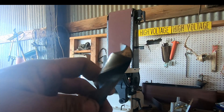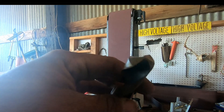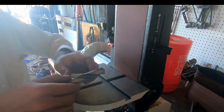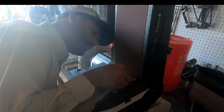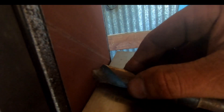Put something on here that can easily adjust the angle. You take your drill bit and start matching the two different angles that are on the bit — one will be this angle and one will be this other angle. You put that edge until it's completely flat against the paper and then tighten it down. That is exactly 10 degrees. The angle I'm setting right now — you can kind of feel when it hits flat, and that's the angle you want to maintain.